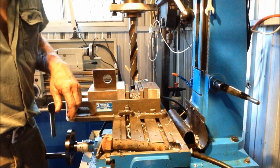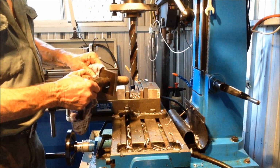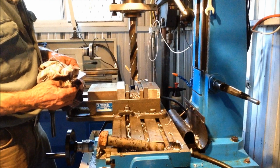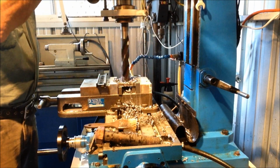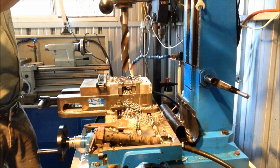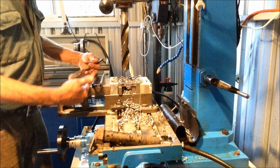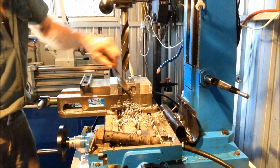Okay. Oh, they're a bit warm. So there's our pin bore. Plenty of clearance. We want lots of clearance. There's 3.5mm of clearance there for the pin, that's exactly what you want. That takes up for any misalignment and that sort of thing. So, all right, we'll continue. Well, that's our holes done. Just keep the other parallel there, it just stops the coolant flowing down over this direction. So all that's left on these is to deburr these holes.